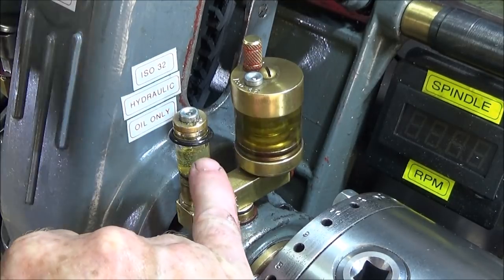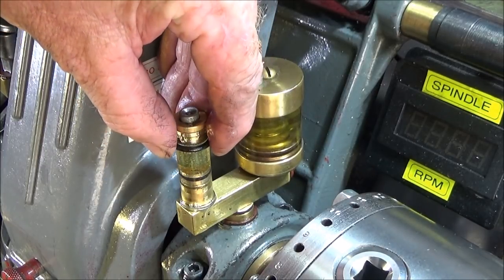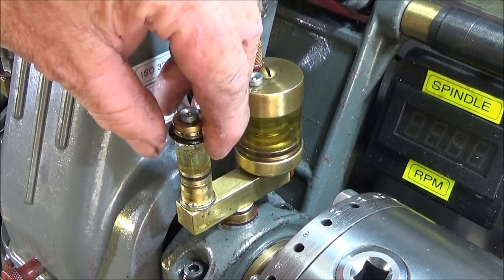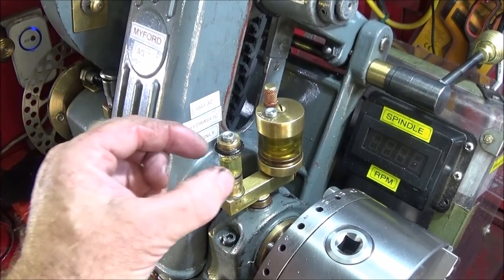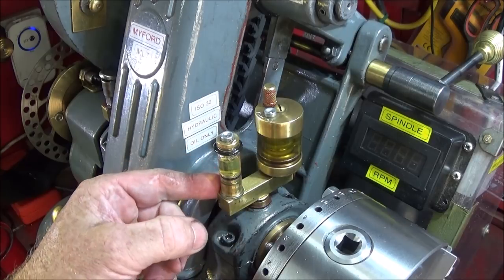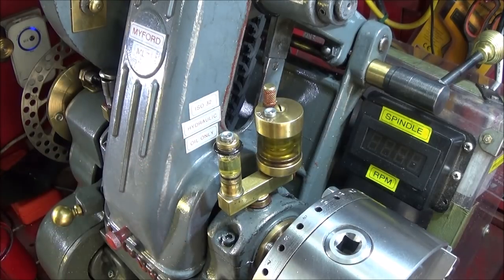And it has a breather hole in the side here which I can adjust with this O-ring, so I can actually close the hole off to lower the flow or to stop the flow altogether. And in an upcoming video I'll show you how I actually make this one. And I've only made the front one so far. It's got a 1/8 BSP thread on the end there with a 1/8 Doughty seal. I've got to make the back one up, so I'll save that one for the video I make to show how it is actually made.